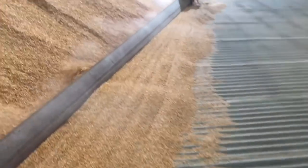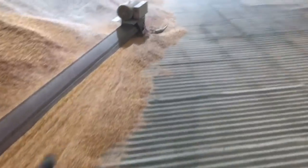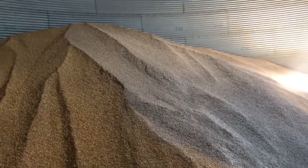Once it starts pouring, you'll notice certain areas break off and come down, so you just kind of gotta let it do its thing. I've seen the Keep History brothers — they run it around a second time, but that's not worth it for this bin because this sweep is running level right now. They do that because they have it elevated, then take the riser out and make it level. You can imagine there's a pile of corn probably 10 to 12 feet tall up on the wall.